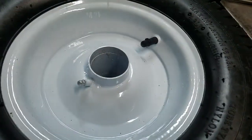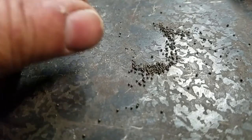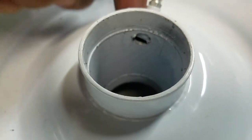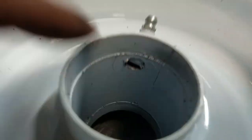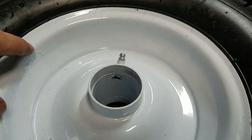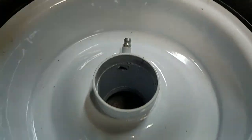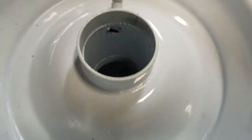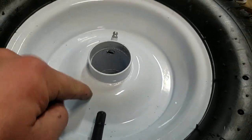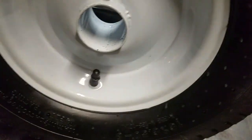You'll notice that these have no bearings in them. That was because when I was about ready to install them, I happened to glance inside and realized there is steel shot in the wheels. It looks like this hole was either missed-bored or this insert was misinserted — it kind of comes up short in this cavity. Not in the tire itself, but in this cavity it appears to be sealed off. This cavity has steel shot in it. I'm gonna try to demonstrate this — it's like a maraca.